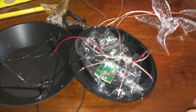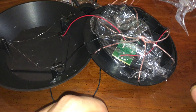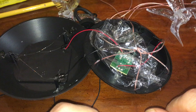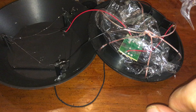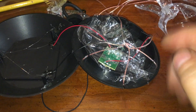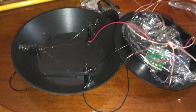That's it — stop water from getting in and this will last almost forever. You could also seal up the circuit board completely, but I haven't gone that far. I have solar lights that are over 10 years old. Some are built really well where they redirect water away from the circuit board, so you only get minor corrosion from condensation, not direct water. But they did have switches, and all their switches just rusted out from condensation — two pieces of metal touching but not soldered, so they corrode and stop making contact. I had to go through and bypass the switches.